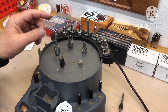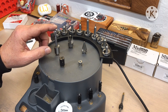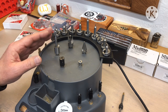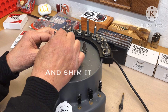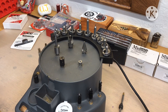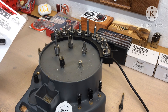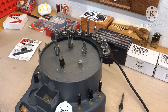In the chat I mentioned: if you're too long, which is very rare, you can take a little off the nose. If you're too short then you've got a problem. However, if you really want to make them longer, it is possible to back out the trimmer since they're friction fit, and that way you'll have a longer case. In this case it's perfect. The book says to trim to 1.750, and this trimmer is doing about 1.752, which is just fine.